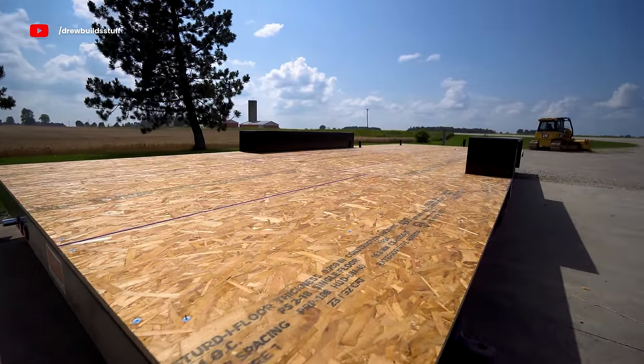Then I ripped an angle into another 2x8. And I made sure the face on this piece was 5.5 inches, just because that's the width of a 2x6 and is a pretty standard measurement for getting fascia later on. And then I screwed in these little brace things I made up since I'm working alone today. And I nailed these boards on as the fascia board.